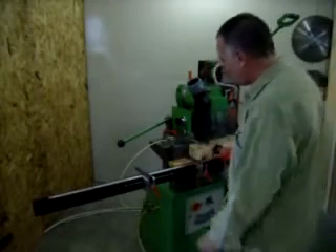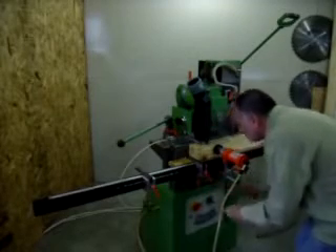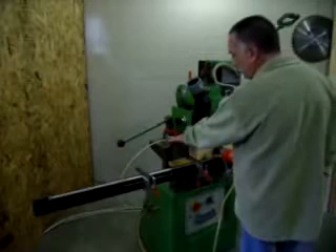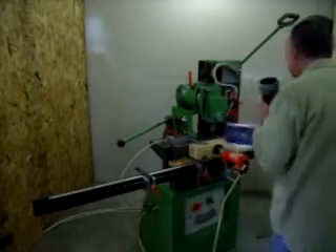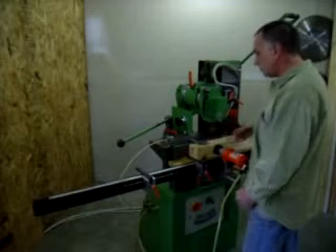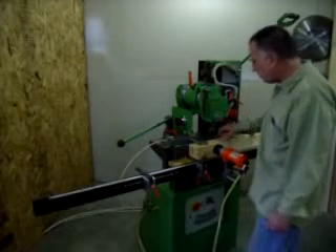The flip stops and the graduated fence are nice. The height adjustment on the table is a rack and pinion — loosen these, wind the table up, and it pushes your wood up until it touches the stock. Another great feature is the pneumatic chip breaker. As soon as you start the feed, it presses down and holds the wood down right in front of the chisel tip, so as the chisel tip is coming out, it doesn't tear out any fibers and give you any splintering.